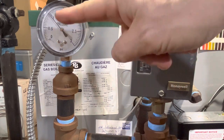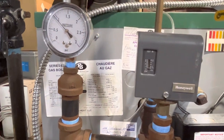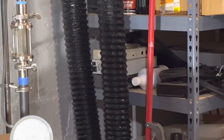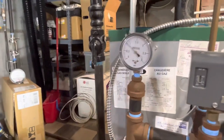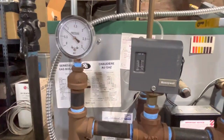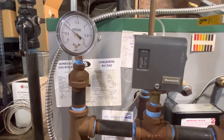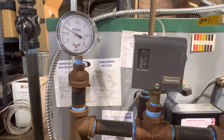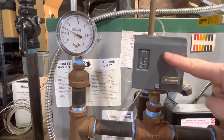There's still steam in the system. There's still condensation occurring. There's the water. You know there's still steam in the system because we can see it on the pressure gauge. So your radiators are taking on the steam they can take on. There's no benefit to burning your burner longer, in my opinion, on this. So just run it down to the bottom. Don't mess around. There's no reason for it. And if you have at your disposal a vapor stat.